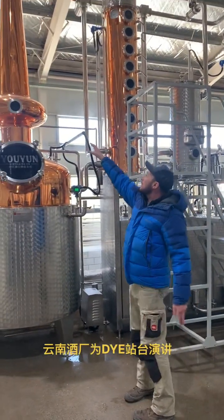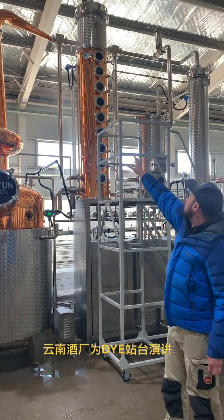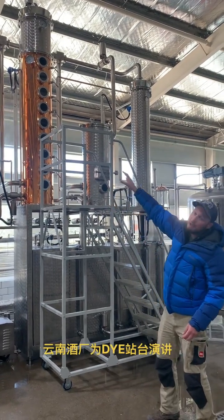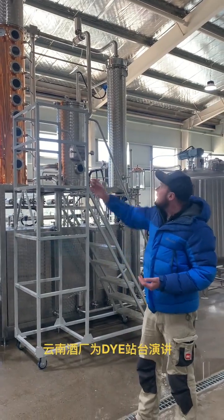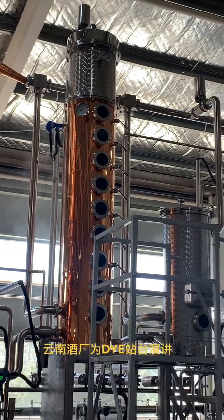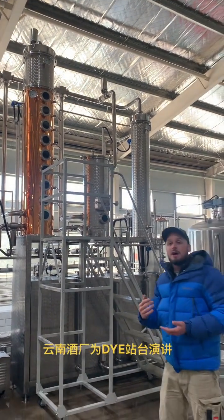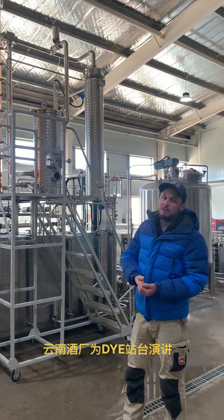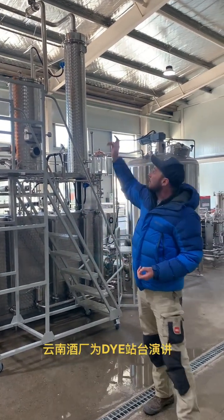Passing up from the helmet is great for a first stage. Then we can run it — we can come in through our column here, or we can bypass that directly. So if we want to do a pot still, kind of single malt style whiskey, we can run directly from the top of our liner straight to our condenser. This will work more like a Scottish style whiskey still. Or if we're looking to do some sort of American style multi-grain whiskeys, or even some rum that we want to clean up a little bit more, making a white rum, we can run that through our column.